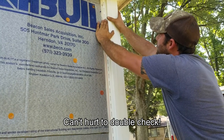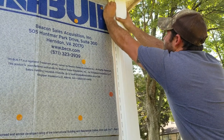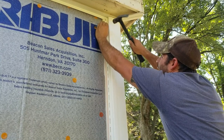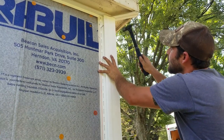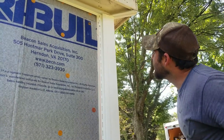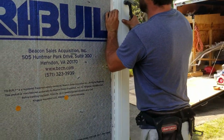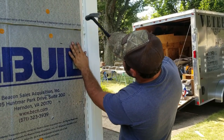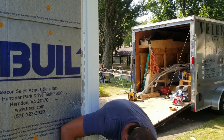I'm going to cheat off this line a little bit - I think it should have been three and five-eighths, not three and three-quarters. What I usually do to start is I'll put a nail right at the top of that flange so it can't drop. I'm going to let that line show just a little more than I would have liked, but this should land pretty square.